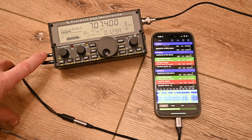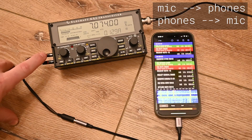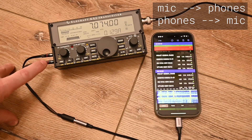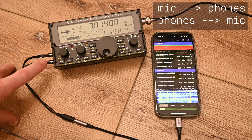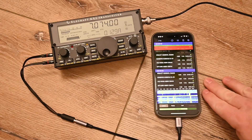Unlike what you would expect, the microphone is actually going into the output port for the KX2, and the headphone port is going into the microphone port. That's just a quirk of the way this cable is wired up, but it works great. So you just need to flip those — it's a little bit counterintuitive. And then on this side, on the iPhone, we're running iFTX.